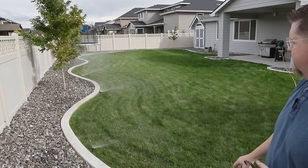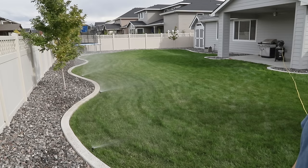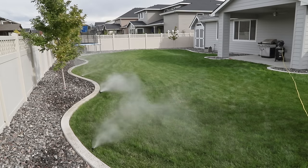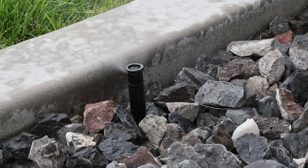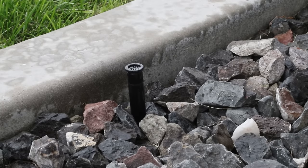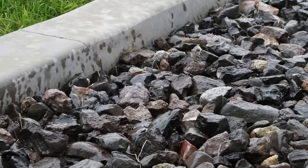You can see they're all blowing water still, but before too long all that water will have been pushed out of the system and they'll start blowing air. I've shown you the entire setup and getting started with blowing out the stations. From here on out, it's just cycling through each of the stations until all of the water is completely out.